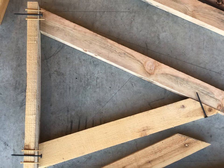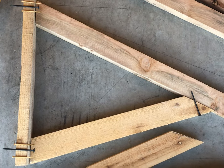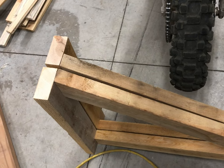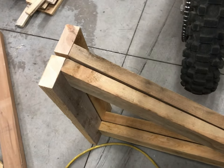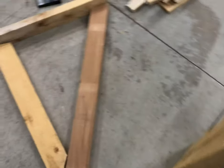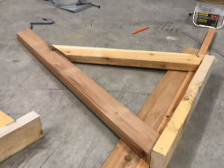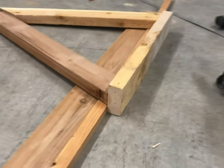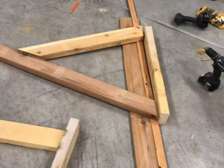Here's a quick screw layout of how I plan on attaching everything — I've got three-inch screws and four-to-five-inch lags. As you can see, the outside framing is easy because you just work off it flat on the ground. For the inside, I decided to center up the framing with a little shim in to make it look a little more symmetric.